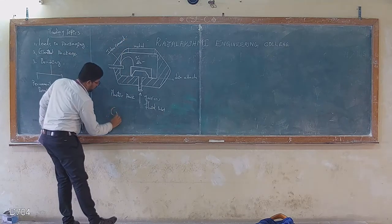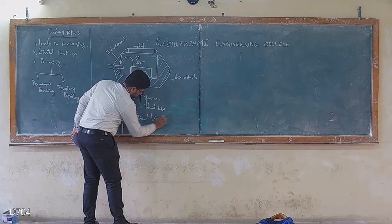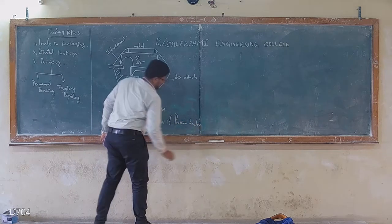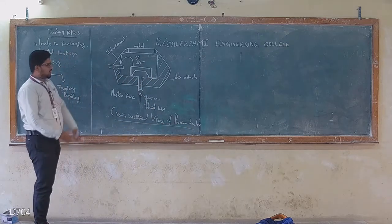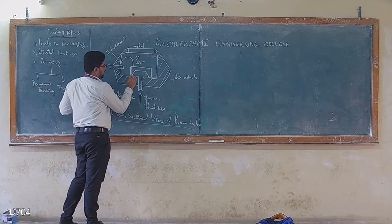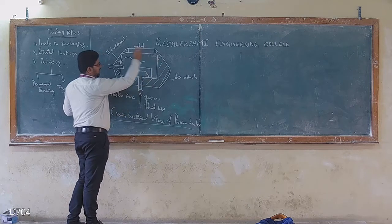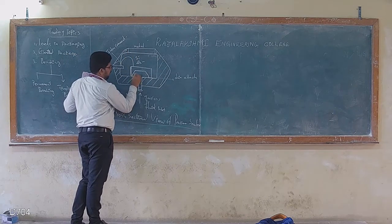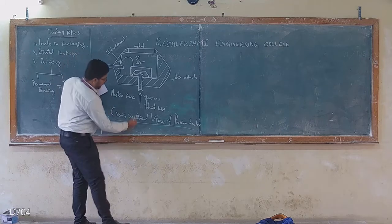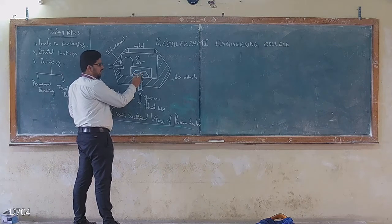So this is the cross-sectional view of a device, a pressure sensor. Let me explain the principle of operation of this pressure sensor. This is the cross-sectional view where the pressure measurement die, the silicon diaphragm, is located. Inside, the diaphragm is completely sealed with plastic mold along with the metal contact. This inside I will call a cavity, right? Let us take its volume as 1 mm. If gas flows in or out, the concentration and amount of gas inside the cavity will vary.